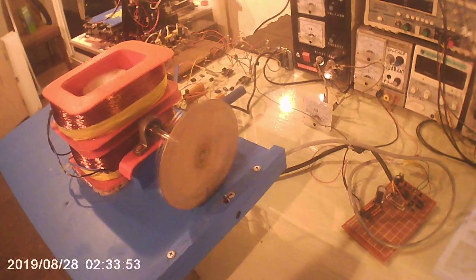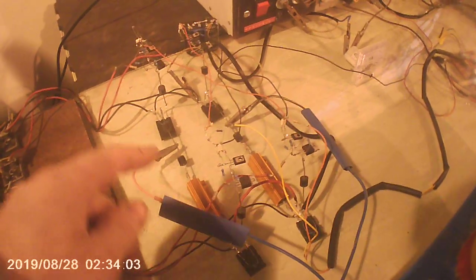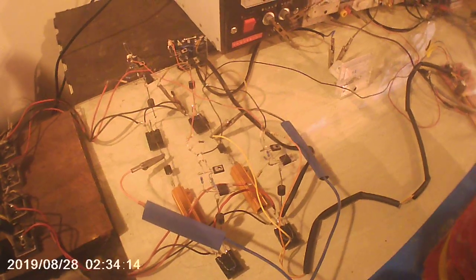That's a shame. I wanted to see what the design is actually capable of, so I've come back, taken a few hours out of my schedule, and replaced all the main drive transistors. I've taken out the two 80 ohm resistors and replaced them with some 10 ohm resistors — so there is a little protection in there but not much, so if something goes wrong it'll hopefully not blow up, but it probably will anyway. The plan is to eliminate these transformers from the circuitry and simplify the H-bridge considerably.